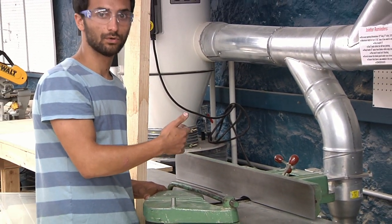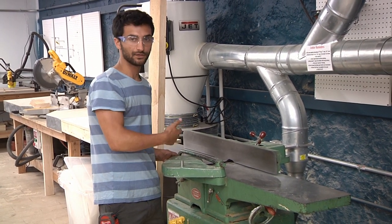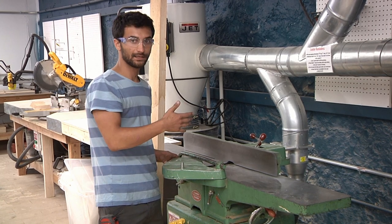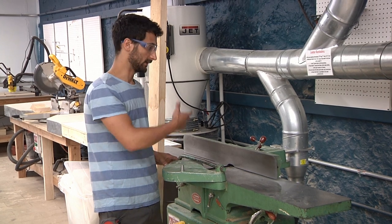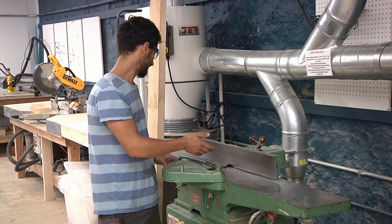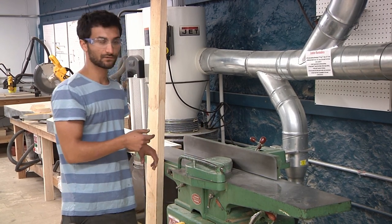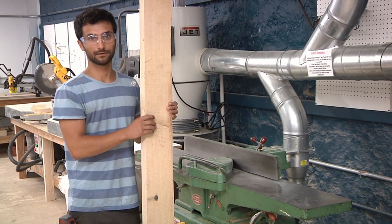If you're buying wood from most hardwood lumber yards, they will offer to do that for you. So they can dress the wood either entirely or just one face and one edge. And the reason they do that is because it can be helpful to have big industrial machines or a jointer, which some people may not have. But the reason they would only do two out of those four faces or sides is because once you have that, you can do the rest with other tools.